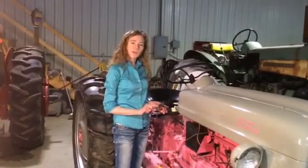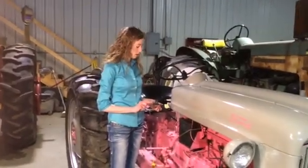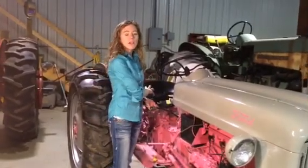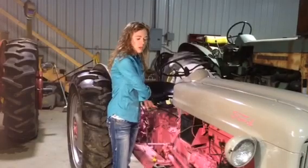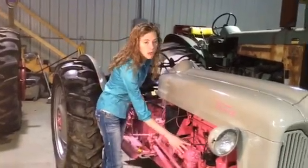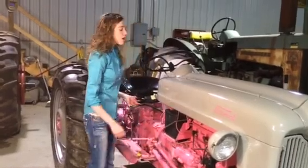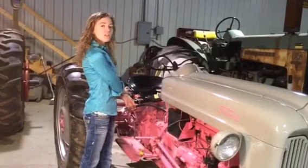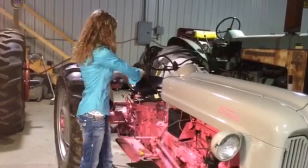The next thing that you'll want to do is use a blow-off nozzle. This one that has a point on it is a good type to use inside your hydraulic pump. We're going to blow some pressure into the reservoir and this will make the hydraulic oil that's in the reservoir come up into the pump so that you can get a prime on your hydraulic pump. I'll start the tractor up, put it down to a low idle, and put the pressure in until the hydraulics work.